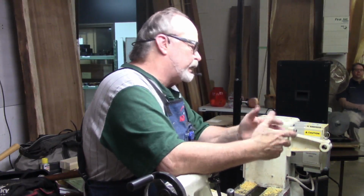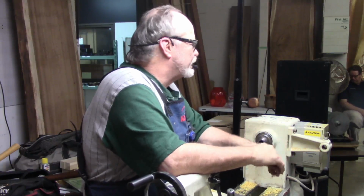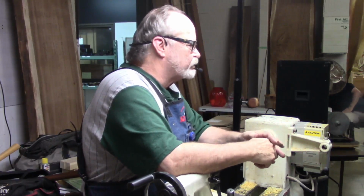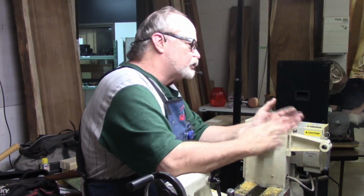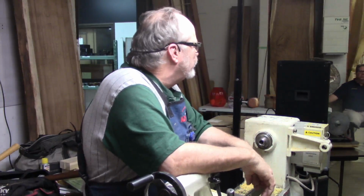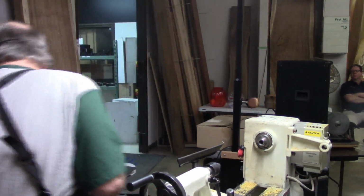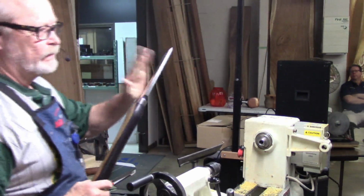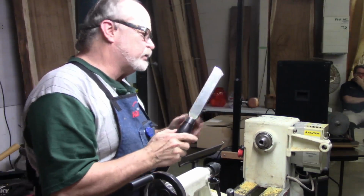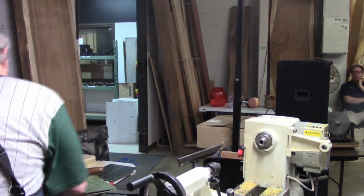When I started, everybody honed their tools. If you told Bob Stocksdale, Rudy Osolnik, Dale Stubbs, don't hone your tools, they'd laugh you out of the room. Like, what do you know that I don't know? You wouldn't get very far with those 3. Then when steel changed, the hones no longer worked, and I used to watch demonstrators make fun of honing. You take your grandpappy's hard Arkansas, I can promise you there's things much harder than a hard Arkansas in this steel. So you need to go to either CBN or Diamond. Diamond and CBN will cut everything on the market.